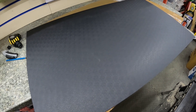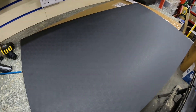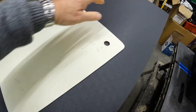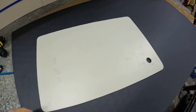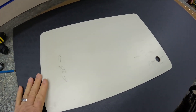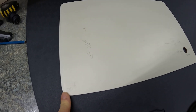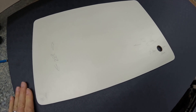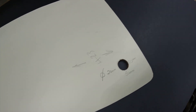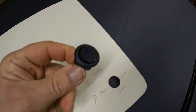This ABS comes in one big sheet, giving us both the top and bottom pieces. To make sure we get it right — since you only get one go at this — I make a hardboard template. We cut it to the right size, get the radius correct for the corners (this case takes about a 30mm radius), and then try it in the case before cutting the plastic. There's also a 20mm hole cut for the on/off power switch.